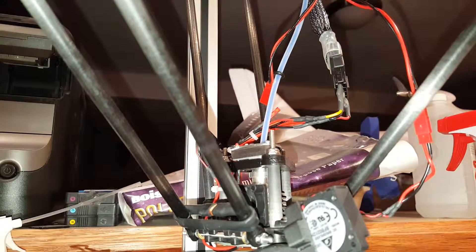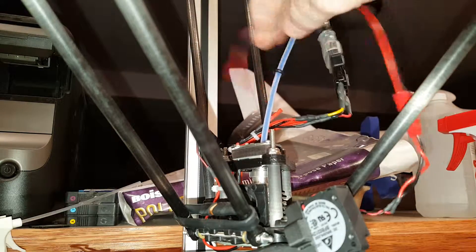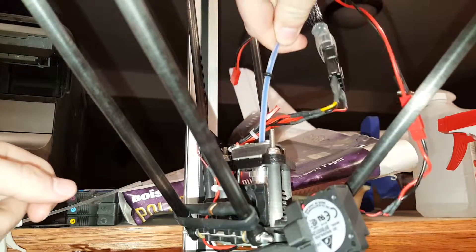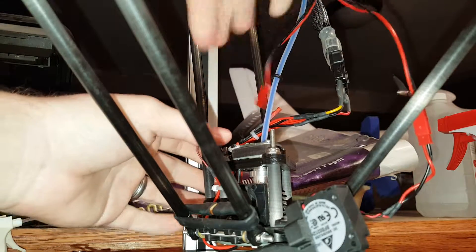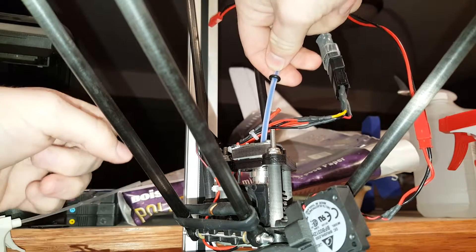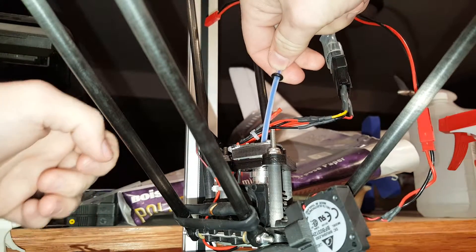What I was going to do is show that the Bowden tube is actually all the way in right now — so it's all the way down. You can see how it moves the whole thing. I didn't do the paperclip on this one because I've been putting it in and out, but it has small — probably about 0.1, 0.2 millimeters — that barely moves.